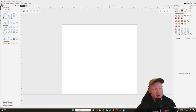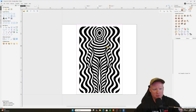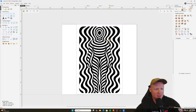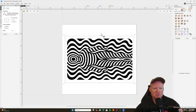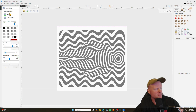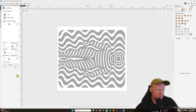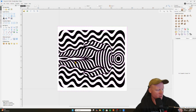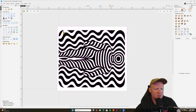I'm going to need some vectors in order to produce a laser toolpath, so I'm going to import my image and then make some adjustments so that it fills out the entirety of the model. I'm going to rotate 90 degrees and then stretch it out so that it wraps all the way around the cylinder. Select Trace Bitmap, select Black and White, click on Preview, and then if you're satisfied with the way those vectors look, go ahead and click on Apply. Click on Close, and now you have these really nice vectors of the image you just created.